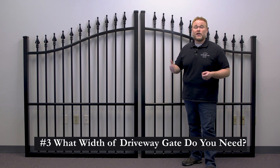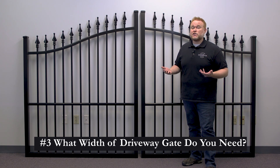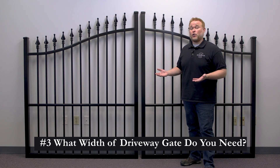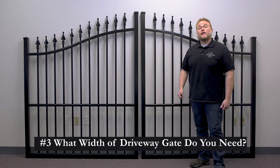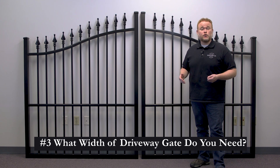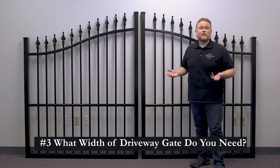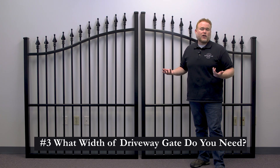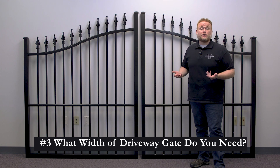For instance, my 10-foot double driveway gate behind me needs closer to 11 and a half feet to fit from outside to outside of a post. The stated width of the gate you see almost never accounts for the post, hinges, and latch hardware. You also want to consider what you're going to be driving or backing through this gate. The width needed for a household with a simple sedan is going to differ from that of a household backing a 40-foot horse trailer and dually pickup truck through it. This gate behind me is a 10-foot double gate comprised of two 5-foot halves. I can drive my full-size GMC pickup through this gate — my pickup truck's about 8 feet wide from outside to outside of mirrors, so it will fit through a 10-foot gate just fine if I can pull in straight and watch my mirrors. However, if I were backing a trailer through at an angle or had something larger like an RV, I'd want something wider for sure.